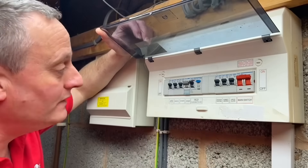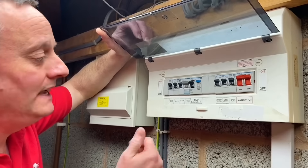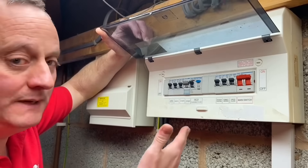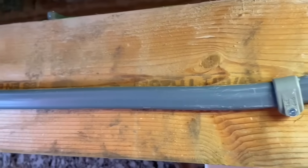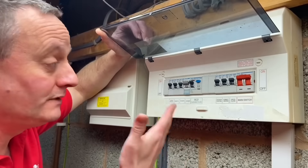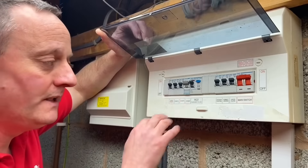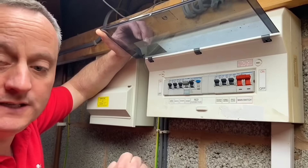Another reason why I don't need to come off this side is RCD protection — there are two things: there's RCD protection already within the actual EV charging point, and also the cable and how it's been installed. The cable for this installation is PVC twin and CPC clipped direct to the fabric of the building, therefore it doesn't need RCD protection. If I were to RCD protect it at both ends — one within the EV charging side and one at the consumer unit — I would lack selectivity. So is it a straight case of coming off the non-RCD side?